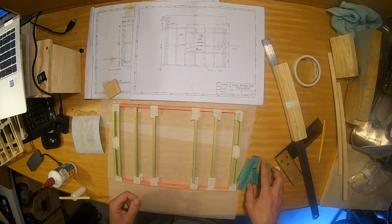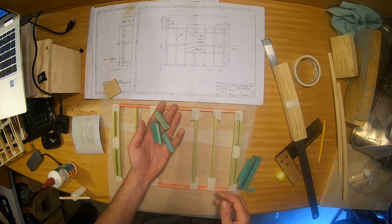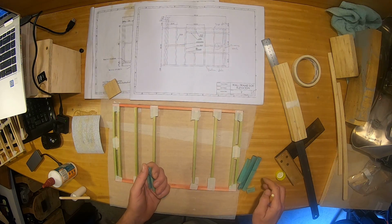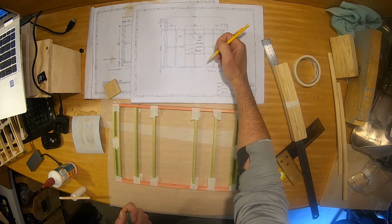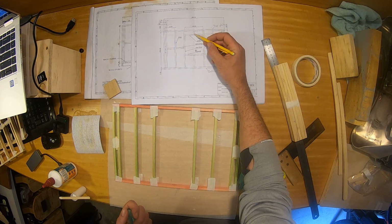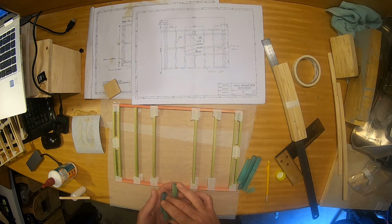I'm back now with these other components. So first of all, the noggins, and we can see those there. We also have a lintel, which is the top part of a window opening, and a sill trimmer, which is the bottom part of the window opening, and a support stud and a jack stud. You didn't actually get this little jack stud in your kit because it was too small and too hard for us to cut, but we can leave it out just for your model frames.